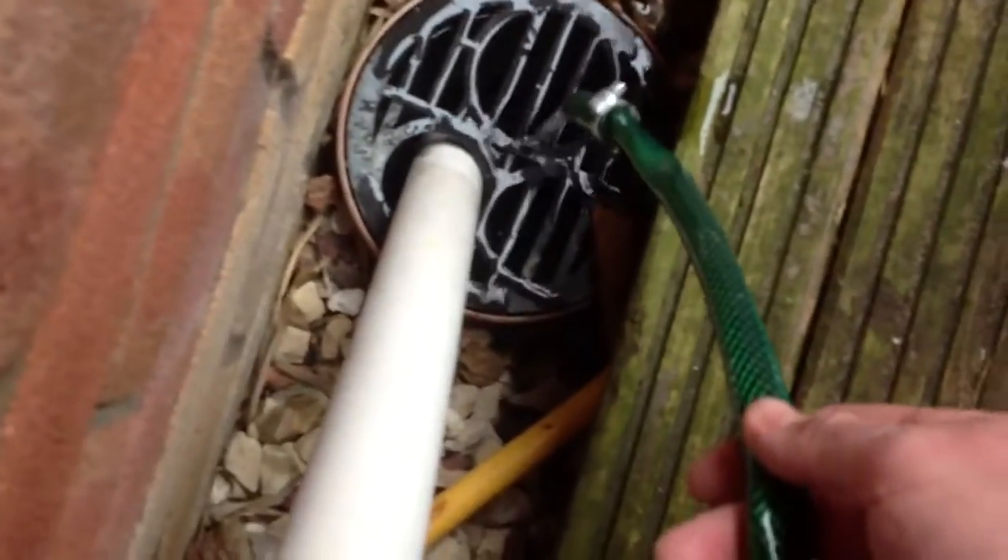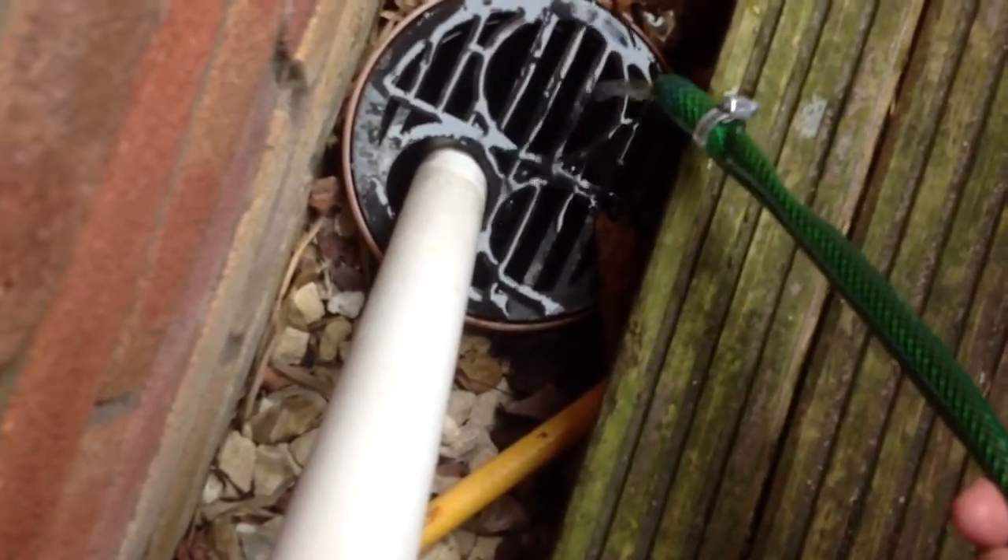There's my hose. One thing to notice — it does look quite clean, the water. It doesn't look like there's any crap in there. Because all the mains is off to the heating, you can latch these valves over. It's a little lever — pull it and hook it over the end. Just latch it into the open position. Now all the radiators upstairs are open. I can hear the air getting sucked in. I'm going to then go downstairs and start to open the bleed valves on the downstairs radiators.